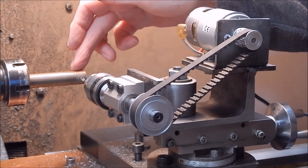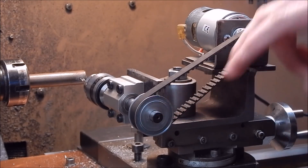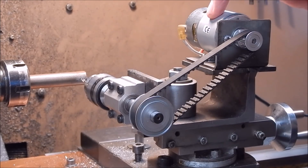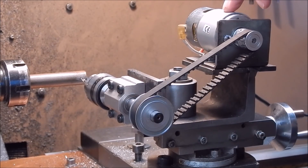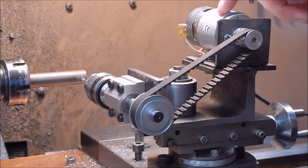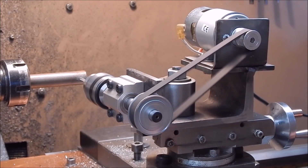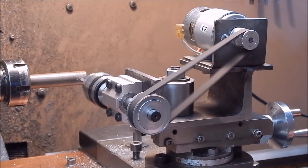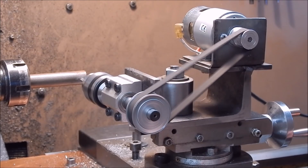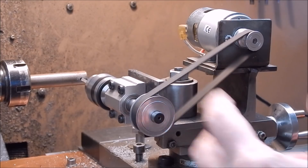This is machine grade steel, this is a 3mm high speed steel drill, this is the standard gearing, and I'm running the motor off a 19 volt scrap printer pack. So it's not running at the full 30-odd volts, just running at the 19 volt speed, and that is a bit under 3000 RPM — I'll speed test it later. It does it easy, so we'll go to a bigger drill and see what happens.